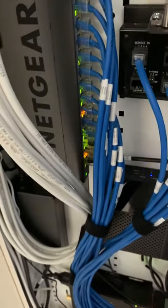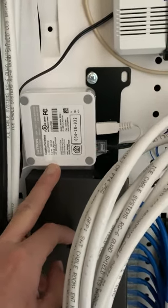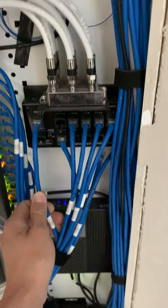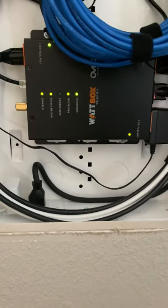That's why we do that. We also have the wireless access points in the home pre-wired, which are connecting to this switch. To give you an idea of what that looks like, it's a wireless access point in the closet. We have our Lutron bridge here — this is for the customer's lighting in the home. We have our cable splitter right here, and we have our phone module for all the phone locations in the house, which can also double as hardline network locations depending on whether or not you want to connect it to the phone module or to the network switch. This brick right here is simply the power supply for the Netgear PoE switch.